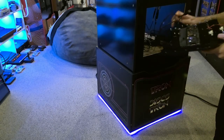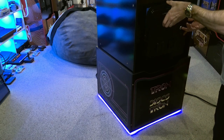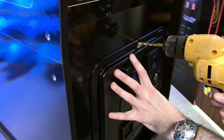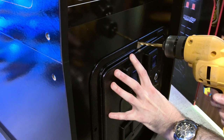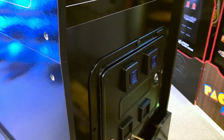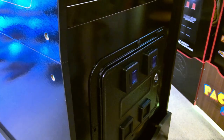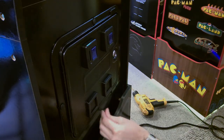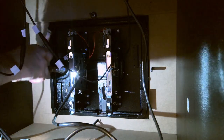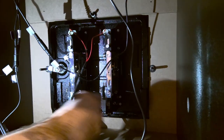Here's our cab fully reassembled with the modified I-panel in place, and now we're installing the coin door. Once in place, we're going to use a drill to drill four holes — one on each side of the coin door — that will allow us to use carriage bolts to attach it to the cabinet. I use standard black carriage bolts you can find at pretty much any hardware store, which match the patina of the door itself. Inside the cab, I'm using a set of nuts and washers to make sure everything is secure.